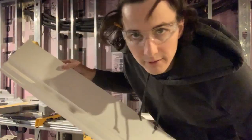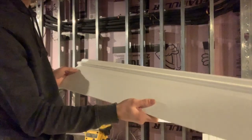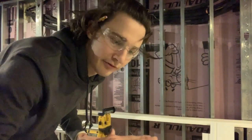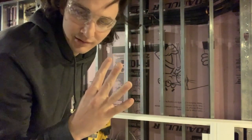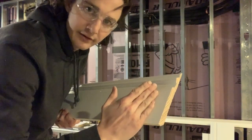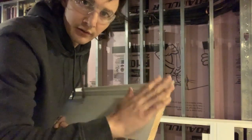I'm going to go ahead and make this square-to-square cut first. My next piece is going to be 33 inches from the cope side over here to the square side. I'm going to put a 45 on this, so we're going to cut this board three different times with the chop saw, and then the fourth and final time is going to be with our coping saw. My first two cuts are going to be on this right side of the board — we're going to cut the 45, then come back and cut a little square cut on it. The next thing I'm going to cut is my length on this side. I'm putting the angle on the right side of the board because we're working right to left.